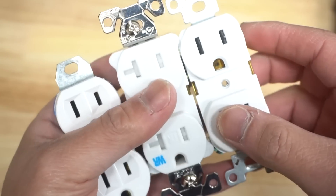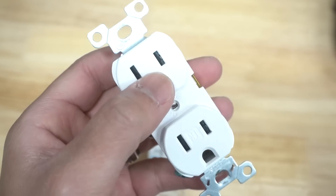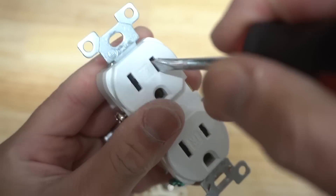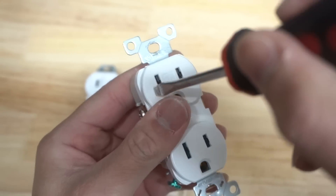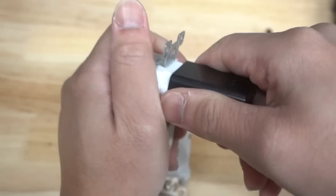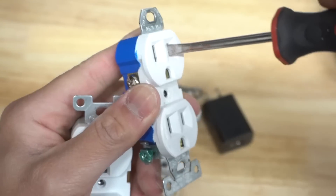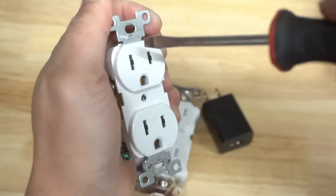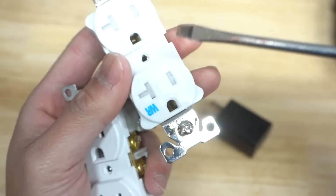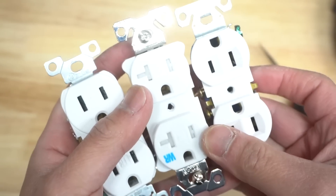Here's another genius built-in feature. Looking at all these outlets, one stands out — it says tamper resistant. If you have kids, this comes in very handy. There's a little stopper that stops foreign objects from going through. I'm trying to push a flat head in and it's not going all the way in because it is tamper resistant without the correct plug. However, when I use an actual plug, it inserts easily. Tamper resistant is the way to go for safety. Some outlets also have water-resistant wiring for wet areas — they're not waterproof, just water resistant. Each outlet has special features depending on how much you want to spend and what purpose it's for.